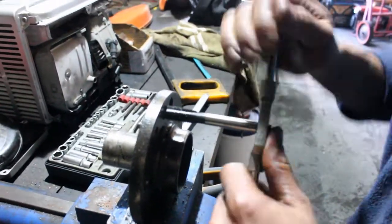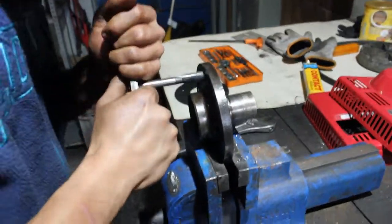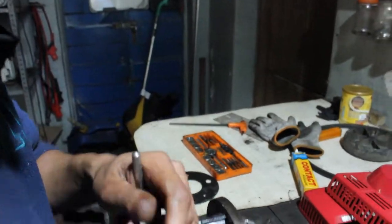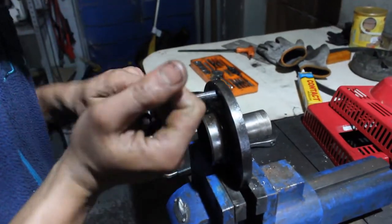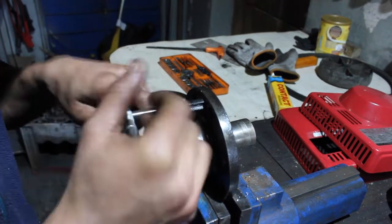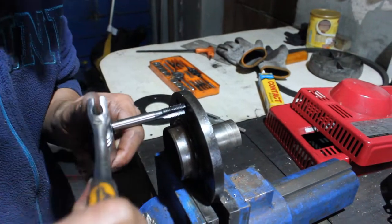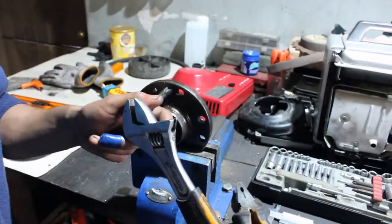This is the tapping process — you turn it and then loosen it again. The reason you open and close it is to clear the thread as you cut it, so you make the thread and then open it again. This last hole, guys — this step is amazing. The other tap I had was not great, but this one is something else. Can't wait guys, 5x100 PCD!